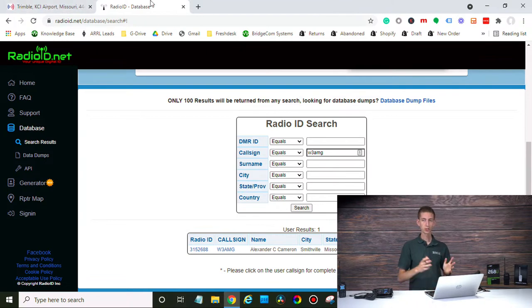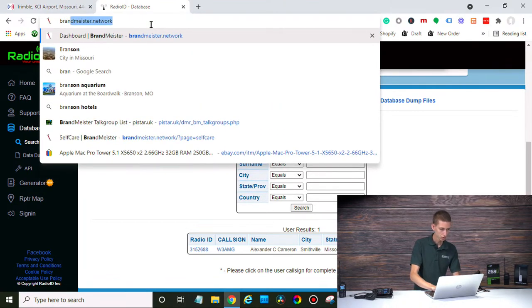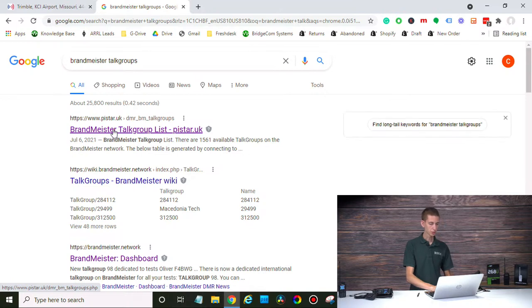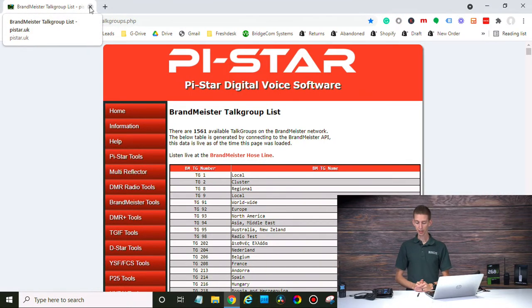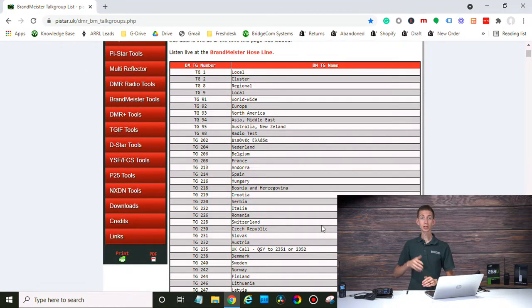Now at this point, we just need a little bit more info, whatever talk groups we want to program into this radio. We want to collect that data. So let's go ahead and look for Brandmeister talk groups. I typically use this first one here, the PiStar.uk website, for looking for my talk groups, but there's a variety of different lists out there. So let's see here. What do we want to program in? We can do the Parrot just to make sure it's working, so let's search for that.